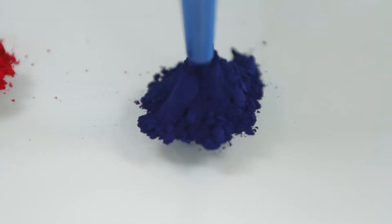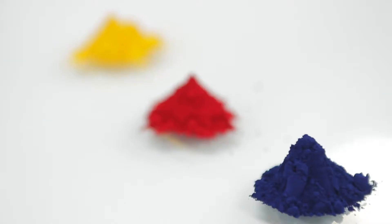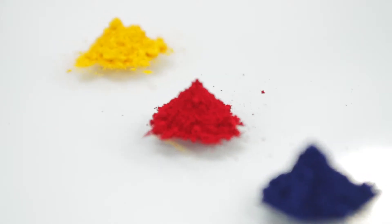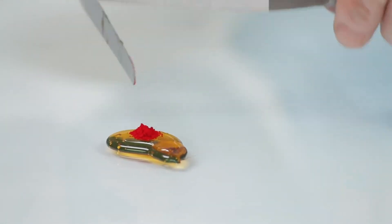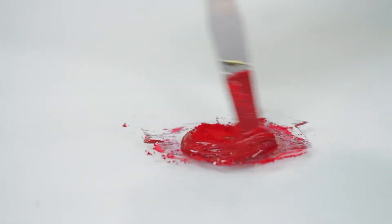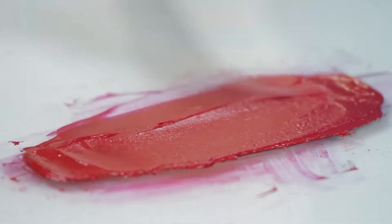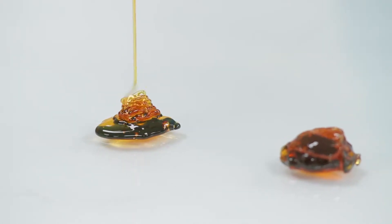Printing ink is composed of two primary things: a pigment, which is the colour, and the vehicle, which is the carrier of the colour. The pigment can be anything — yellow, magenta, cyan, black — it's a colour powder, and we need to incorporate that into vehicle, which is really like a sticky, gooey varnish, not unlike honey, but of course an industrial honey. Some parts of the vehicle are thick and gooey, very sticky, very non-flowing; others are thin like the thinnest water.